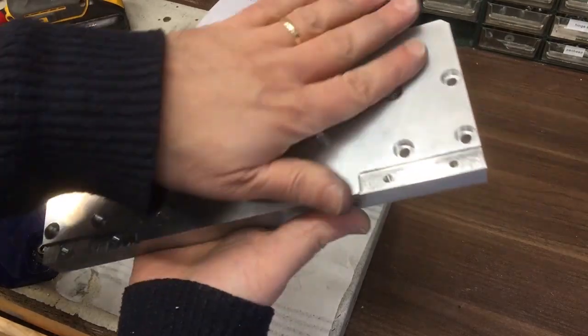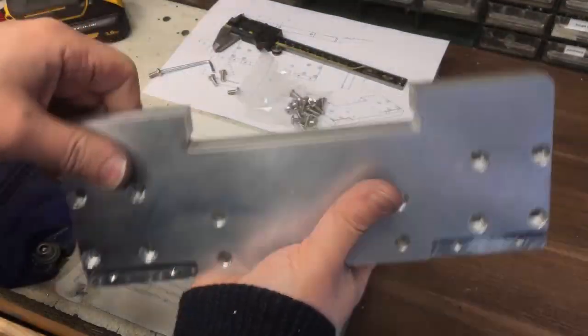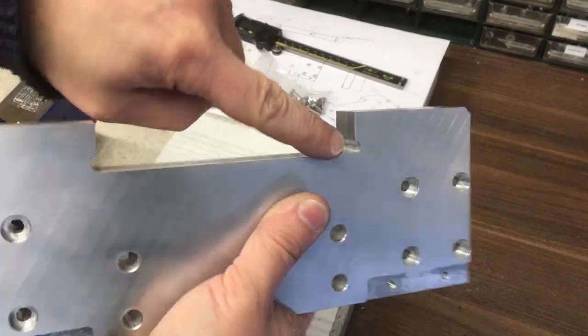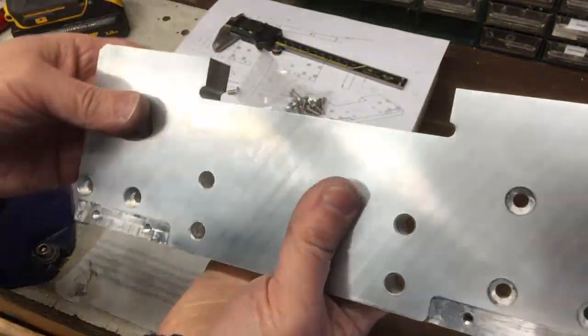Okay, and after a little bit of cleanup, there it is. So we've got our recesses in there, we've got all our counterbores, the through holes, we've got those little eggs, see, it's chattered in there. I must have had the radius of that the same as the end mill. I thought I'd made it a little bit larger, but anyway, we've got the job done.